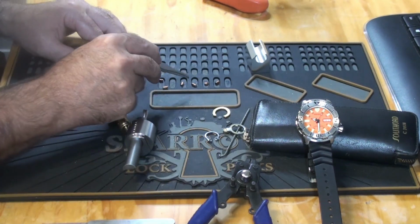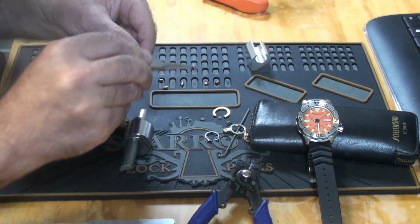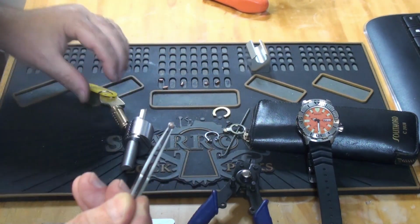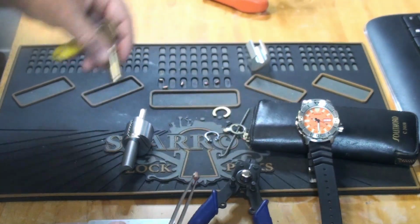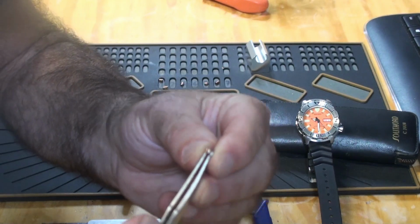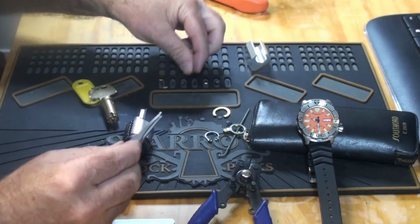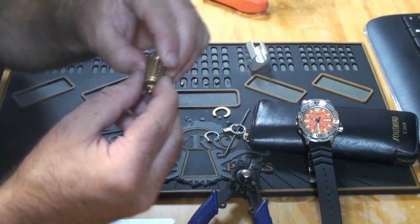And just to show you one of those pins in more detail, let's have a look at 4, which is the one that gives us all the trouble. This is the really long one, and you can see that there's a little wing on each pin, so it locates it in the core so that the thing can't rotate, and then instead of coming to a point, it comes to a 2-part chisel point. So that's where the 2 different bits of the bitting come from.